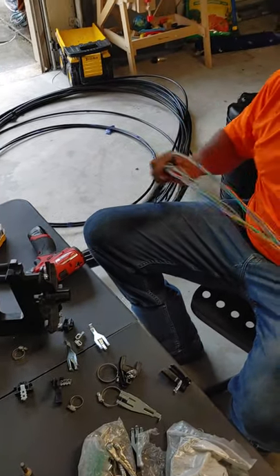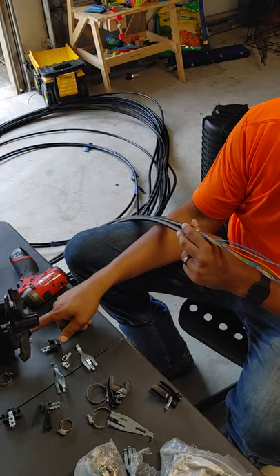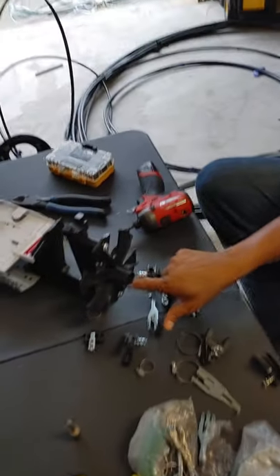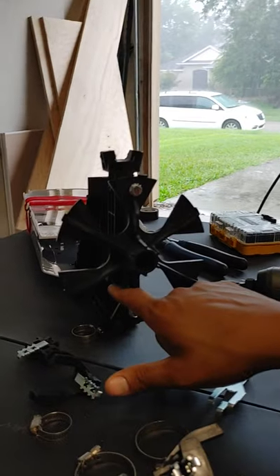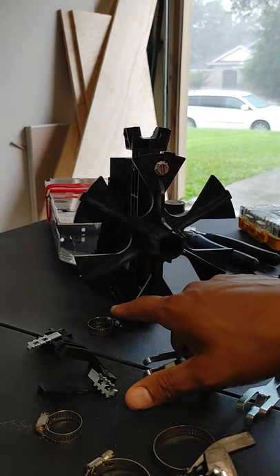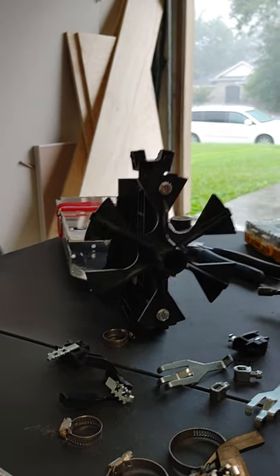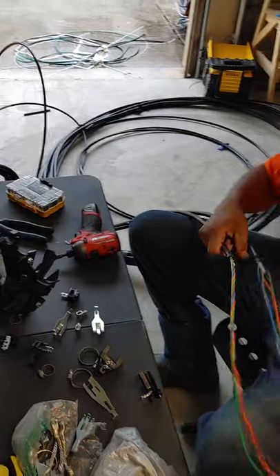You want to verify your input. Depending on what company you work for they'll tell you where you want to do your input, but most of the time your input starts in port 1. We got port 1, 2, 3, 4, 5, and 6. Port 1 is your input, port 6 is going to be your main output, and then you start filling it up on this side and then on the other side. So we're just going to pick one and say this is our input.